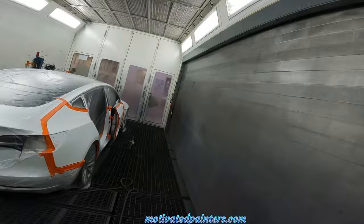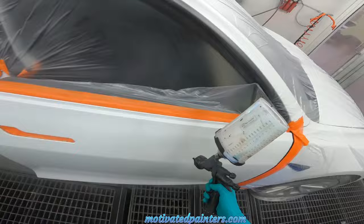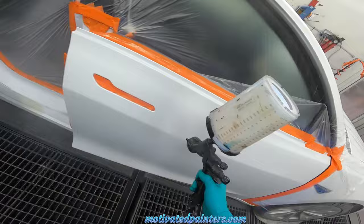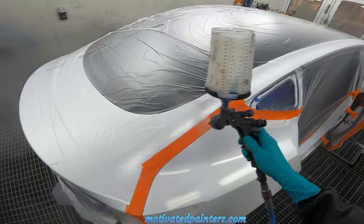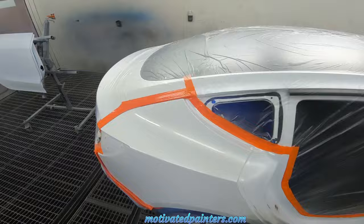I got my wet bed — I mix my wet bed like three to one, mostly. I put it on with a 1.2 because I want to put it on nice and thin, but at the same time have it covered, almost like a pure coat really. I put it on a 1.2 because I don't want any texture, I want it to be as smooth as possible. That's UV primer up there, but you can see hopefully.